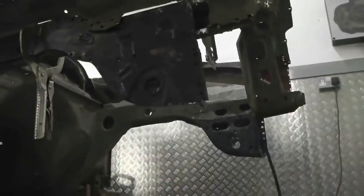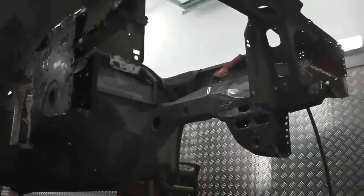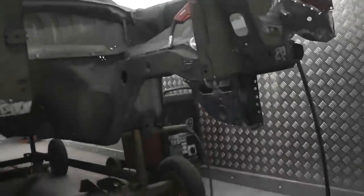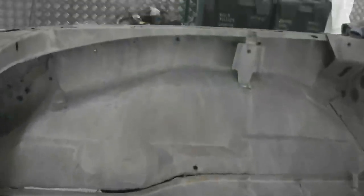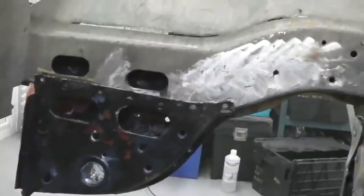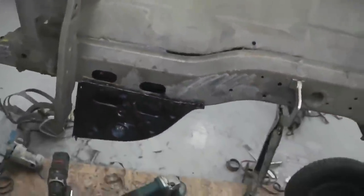So we're mocking up them lower, fully repaired now, front cradle mount point brackets that fit on the C section of the chassis, just making sure they're starting to get a rough idea of the alignment. That's what we want to really do. So the camera takes us round, so we can see the work so far. Bit of that C section that we grafted in.